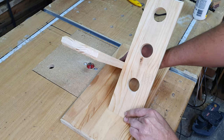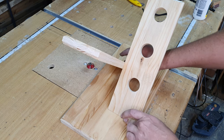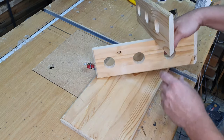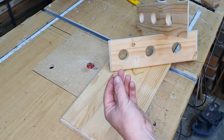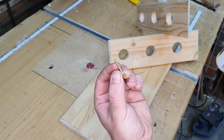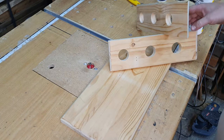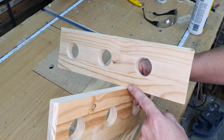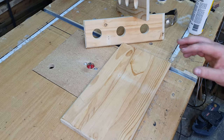From the bottom I'll drill holes in the base plate and attach the uprights to the base with self-tapping screws and wood glue. I'll also be putting glue in between the two planks where the dowel stick is joined, so everything is held together and supported well.